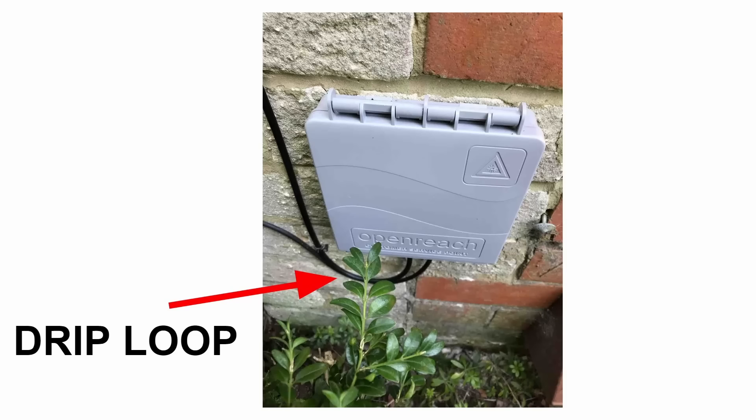In a scenario where you need a socket in your loft but have no socket cables up there, I'd suggest finding an existing socket on an exterior wall, drilling a hole through the back of that socket to outside, then running a spur up the outside of the house and into the loft. However, be sure not to use regular grey twin-and-earth as it's not rated for exterior use — over time the PVC sheathing will degrade in UV. Also be sure to add a drip loop so water doesn't run down into your wall.